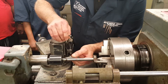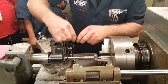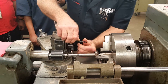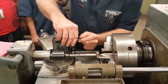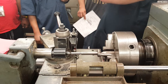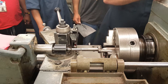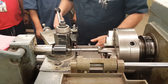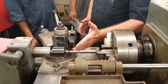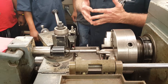I'm going to lock down my set screws. If you can get three set screws on your tool, that's better — minimum of two. Okay, so now I've got my tool height and the orientation of the tool bit set properly.